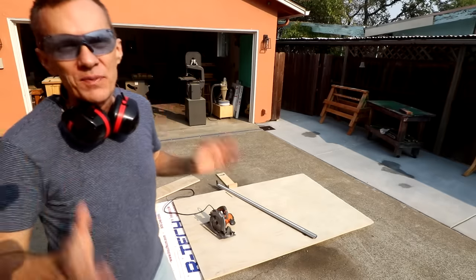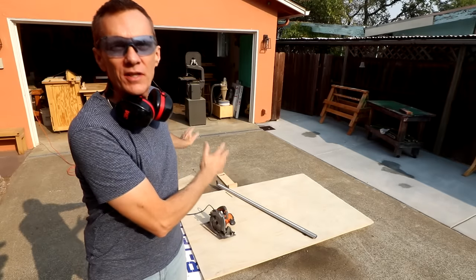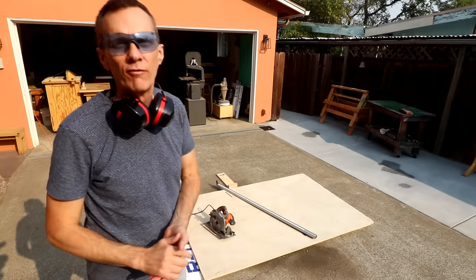If you don't have enough space to store a full sheet of insulation, just cut it into a couple of pieces — that'll work out fine. In general, my strategy is usually to rough cut plywood into smaller pieces that are manageable, that I can rip to their exact dimensions on my table saw or other tools.